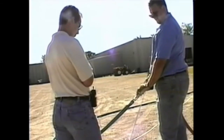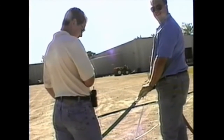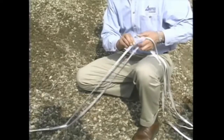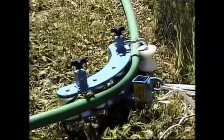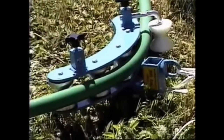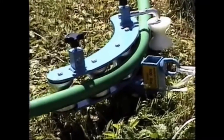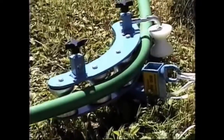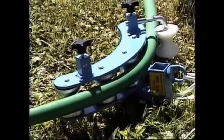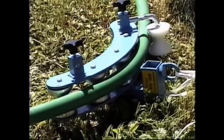In the first test, a Condux blower and an inner duct projectile were used to blow NEPTCO's mule tape through the 1,000-plus feet of inner duct. The 1,800-pound polyester mule tape was then attached to the Condux fiber optic cable puller and pulled at a rate of 125 feet per minute. Seeing is believing, but you can actually hear how smoothly and effortlessly the pre-lubricated mule tape glides through the inner duct, even around the 90-degree bends. And the cable moves just as smoothly with no danger of snapback, thanks to mule tape's low elongation properties.